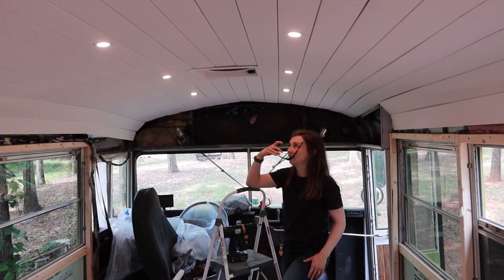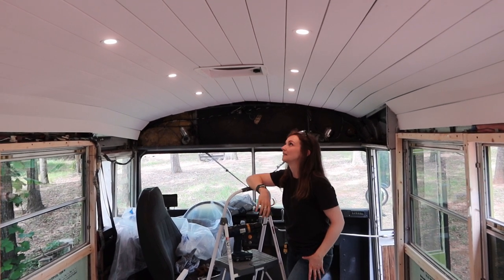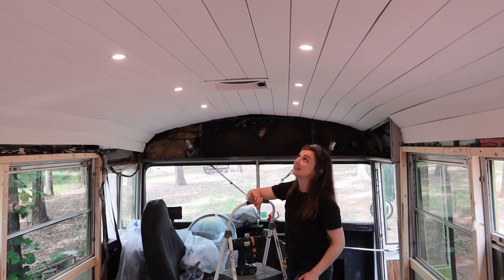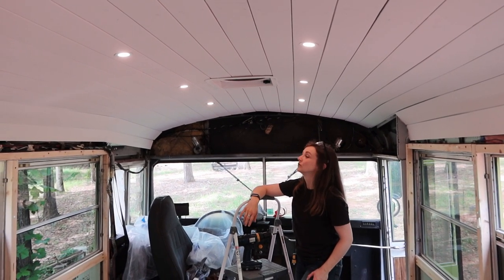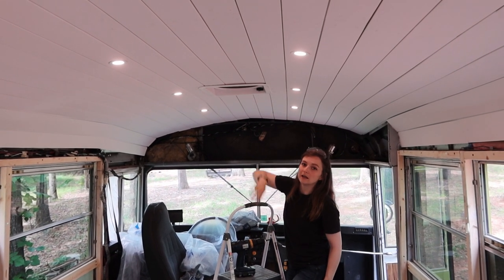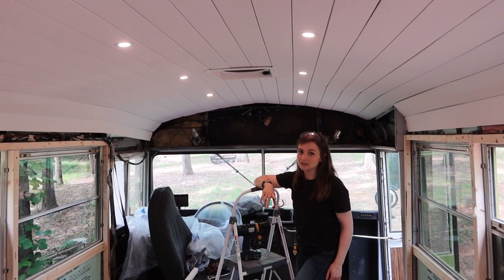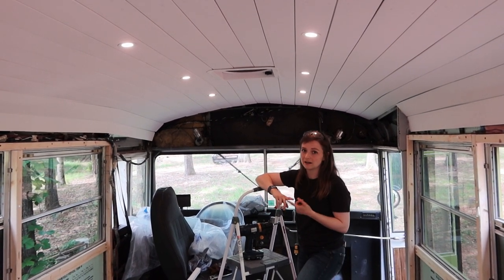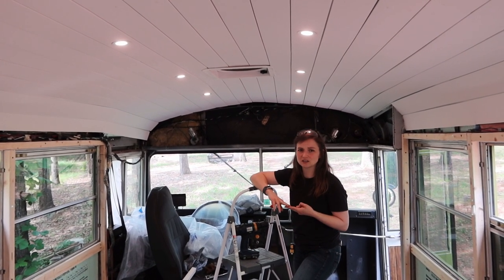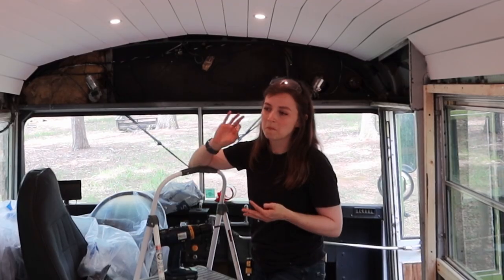We have both of them in, and it looks really good. It's really polished. It's nice to have the exposed shiplap covered up, and it looks really neat. I think the solution that they have for having trim is a pretty elegant solution, because once we found the right saw, it was really easy to cut down. The table saw kind of melted the plastic as it was going, so it didn't really work, and the handsaw was just a little annoying to work with, and the jigsaw was perfect.